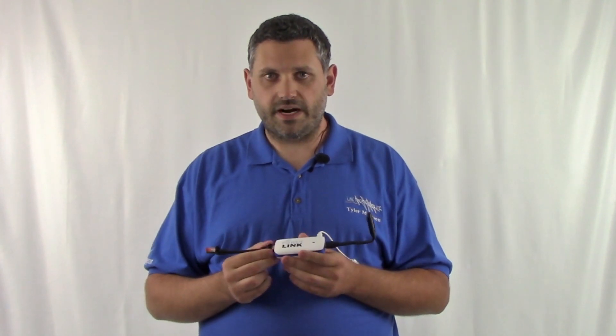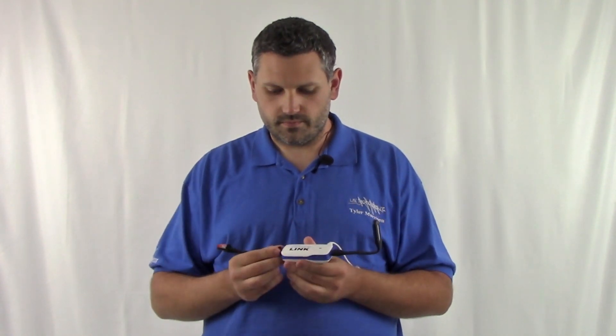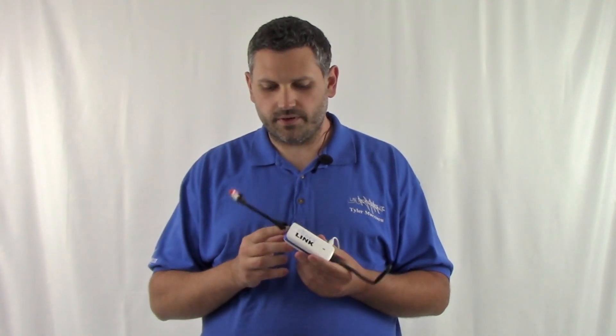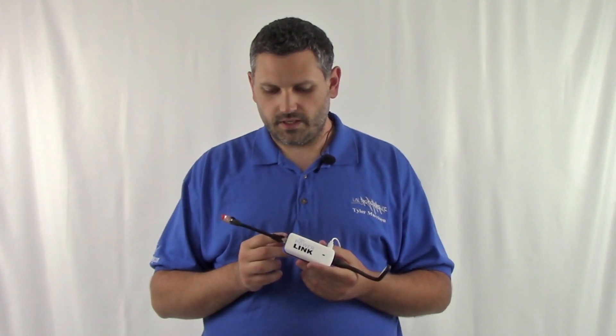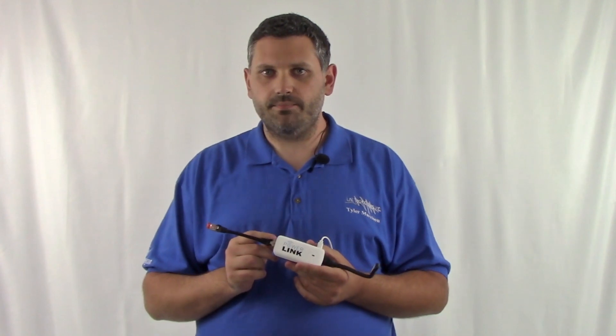To use router functions, access point, or PoE functions, slide the toggle switch all the way to R for router mode. On the RJ45 port, there is a toggle switch. Away from the dot, PoE is off. When the toggle switch is on the dot, PoE is active.